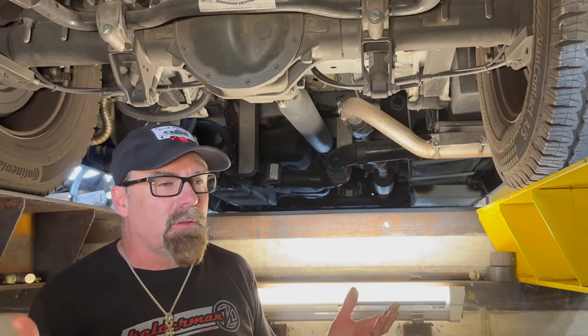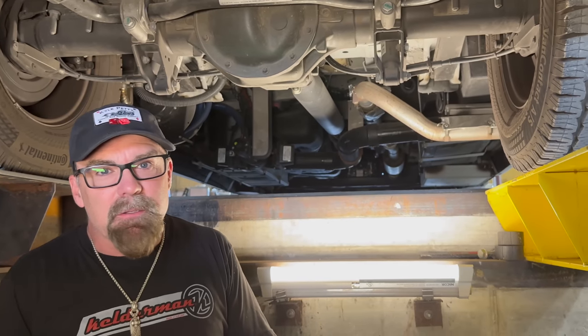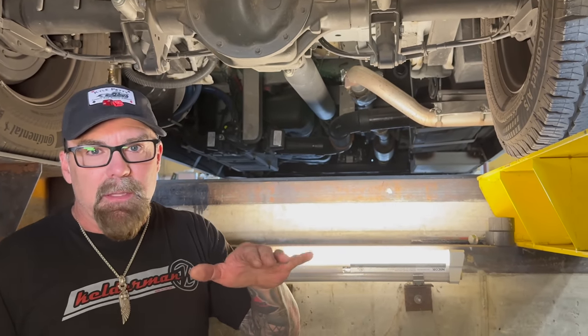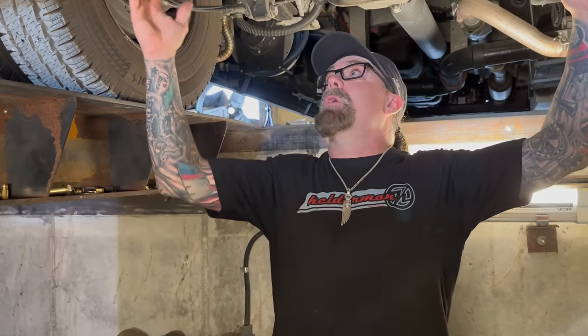When I say lighter vehicle, I mean not commercial use. Chevy on their 5500s now is using that same, they call it a Z-spring, like a semi, and they ride atrocious. And I know it's a little finicky getting it set up correctly, getting dual height control valves not fighting against each other. If you're on dual height control valves against each other, you run the risk of sway bars loading and preloading, and then you got different height control valves.